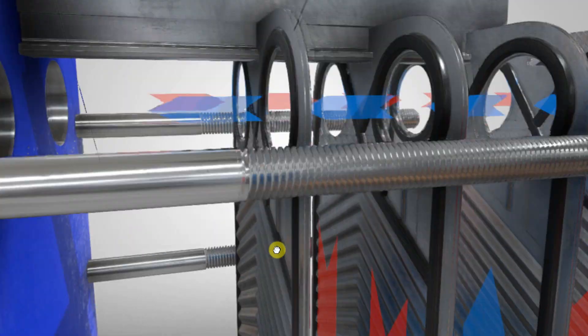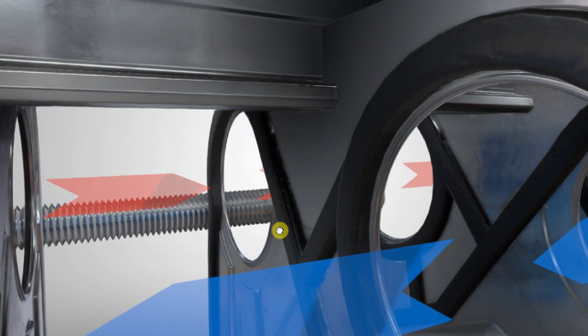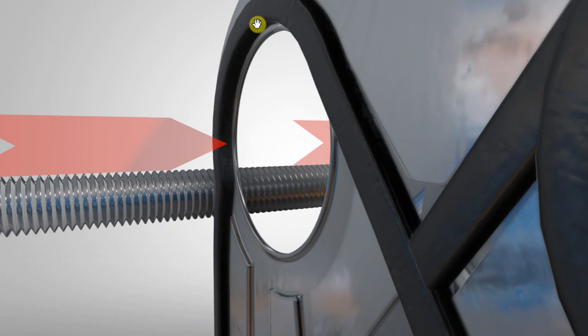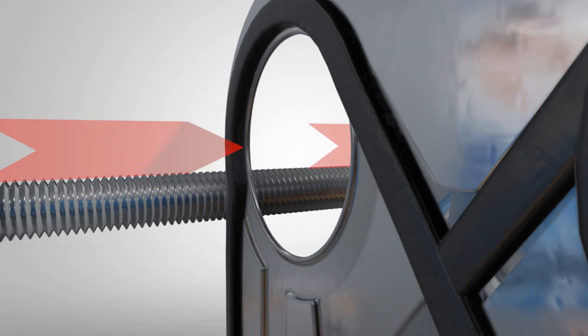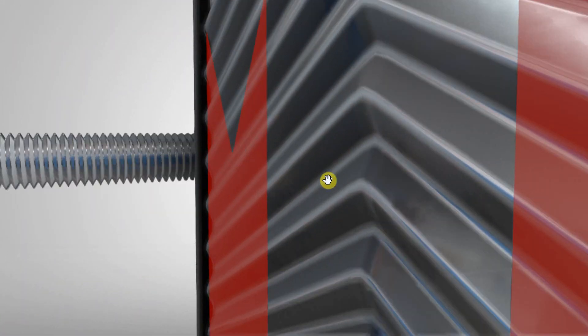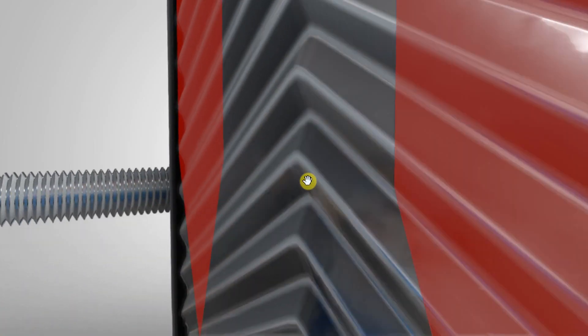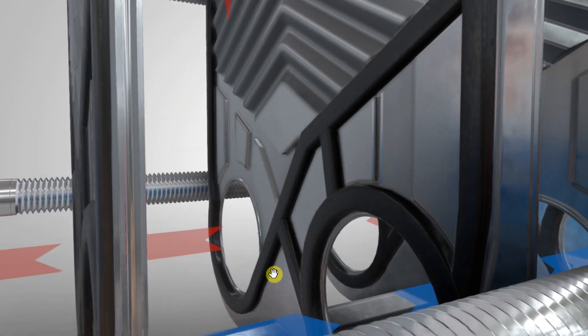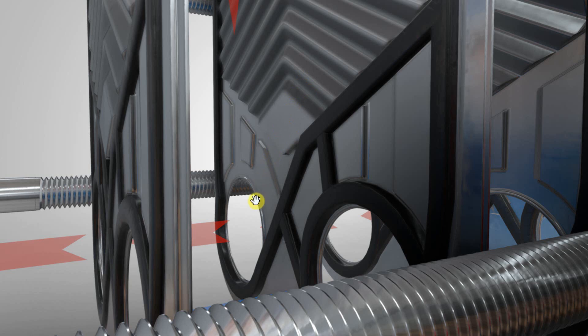On the next side, the gasket has changed slightly, and it is the gasket that controls the flow to every single plate. Imagine this plate is pressed up tight against the one beside it — we're going to allow the fluid to come in, and it's going to flow downwards all the way down the plate. When we get to the bottom section, the flow is going to move to the left and be carried out of the heat exchanger.